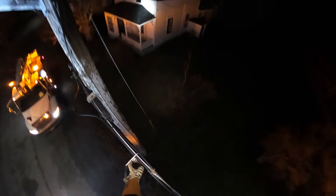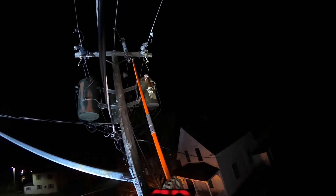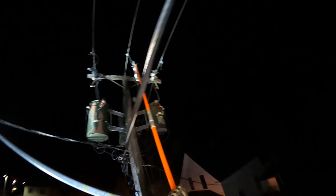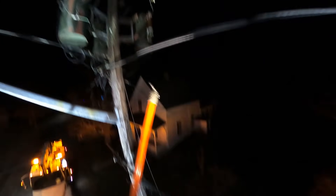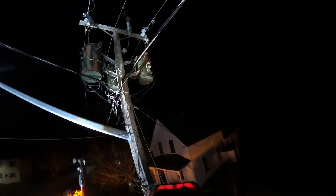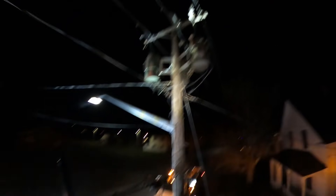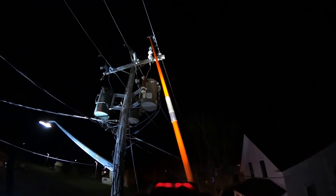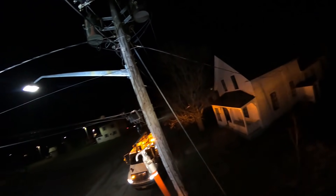When we close cutouts in our particular company, we use a two-piece stick — an A-B stick — or you can use your extendo stick. That way you get a good safe distance from that cutout in case the fuse blows or something goes wrong. It's not fun being close to that — it's loud, it's a flashover — just not a good scene. So you grab your A-B stick, move a safe distance away from that cutout, line that door up, and bring it about almost halfway shut. You don't want to do one full sweeping motion as you close it, because the door might not line up 100% with the hood and spring on top. Lift the door up and get it in the closed position. A good practice is to actually look away from the cutout as you're closing — that way if it does blow it doesn't blind you. Safety glasses or not, that flash is bright. You don't want to be looking at it if there's an error. So we look away, click — line's energized. On to the next.